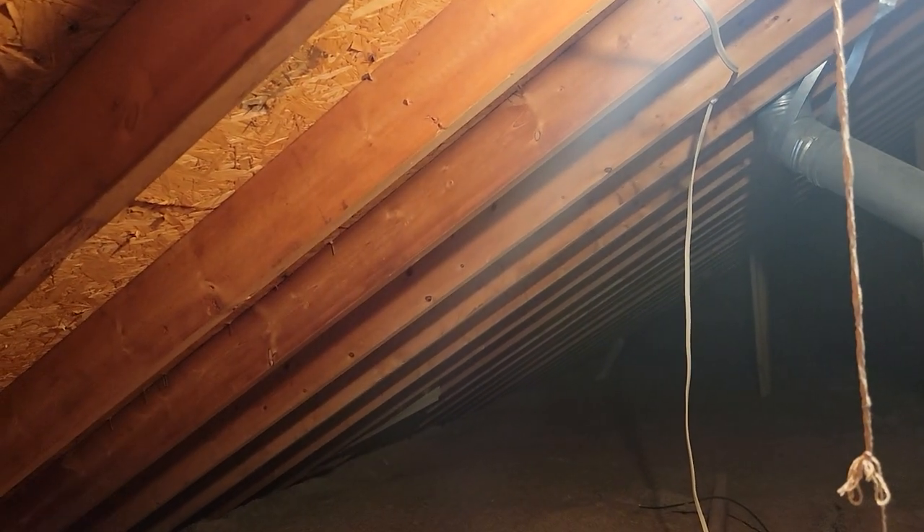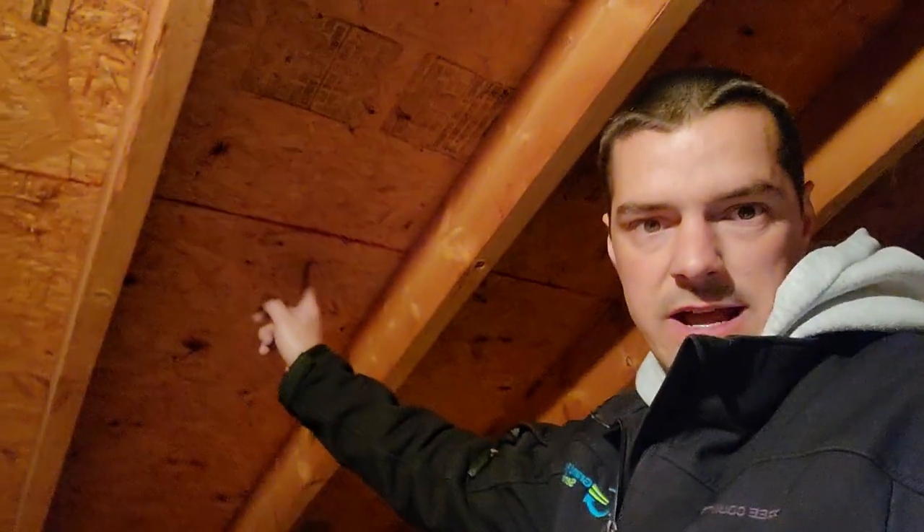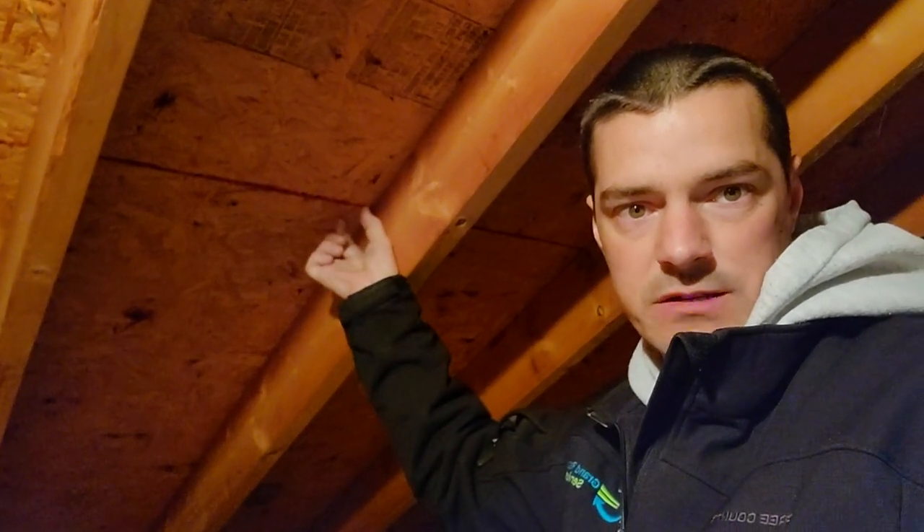The point of the video: without h-clips, the expansion of plywood or OSB causes the buckling. If you are doing a decking job, don't forget to put h-clips in. Alternatively, I've seen guys put a 16-penny nail in the truss just to space the sheet a little bit before dropping the next sheet down, then pull or pound it out — leaving a small gap between all the plywood so that when it expands from moisture it won't cause buckling.